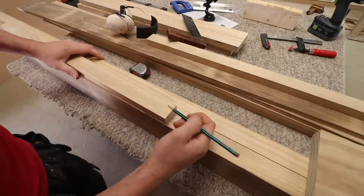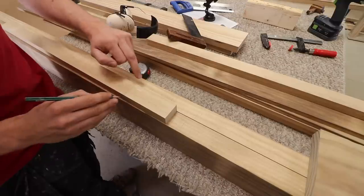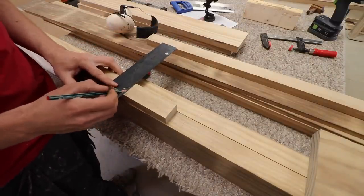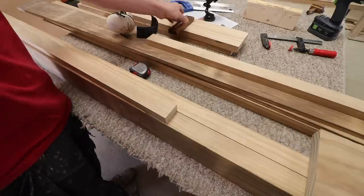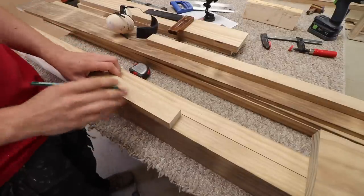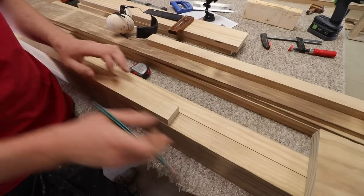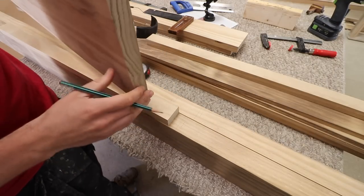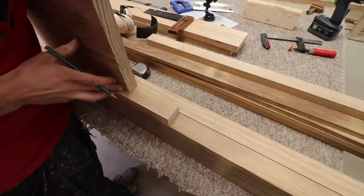Now I use the twin head tenoner and I cut the tenon so that there's a nice square joint between the shoulders. So where the square of the door style meets the two cuts on the shoulders, it's perfectly in line. So I've got no setback for a rebate for the boards to sit in. But the position of that tenon widthwise within the door is partially dictated by the thickness of the middle rails. So these are called a barefaced rail. You might come across that in their joinery terms.